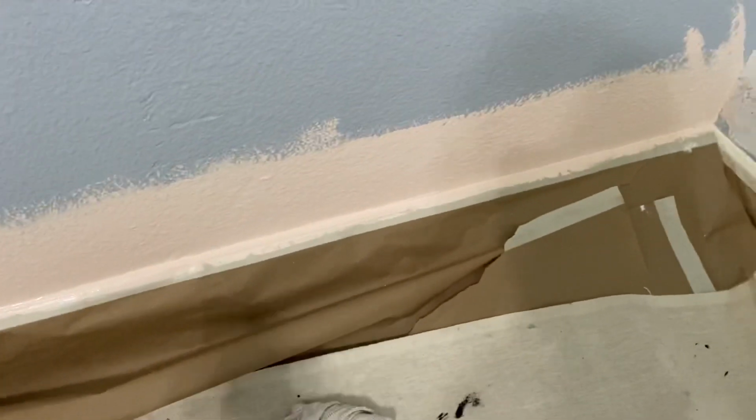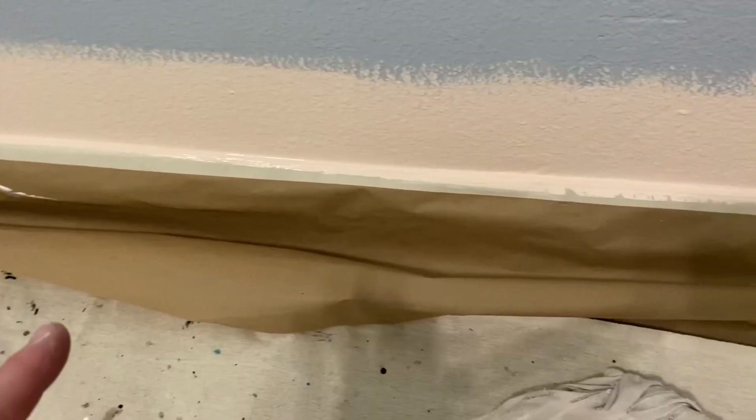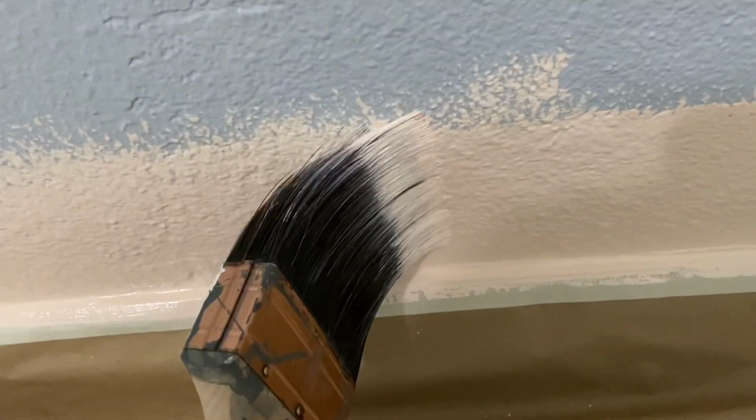Now I'm gonna finish it this direction, because ideally, you want the whole thing that way. I only did it this way because it's easier. But then as you move along from the first 3 feet of the wall, you can't keep going back there. Secondly, if you did, look what would happen. If I kept going back, that's not only a waste of time, but look what you're doing to the paint. You'd see that if that were not textured.